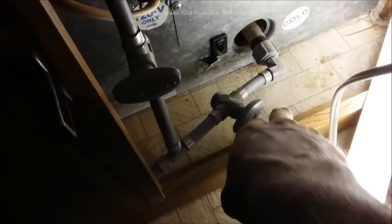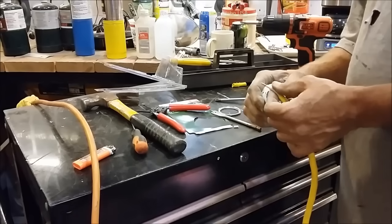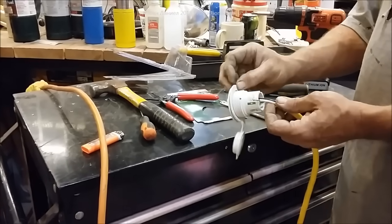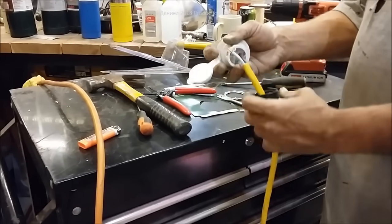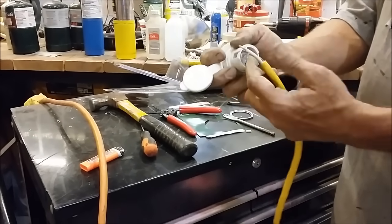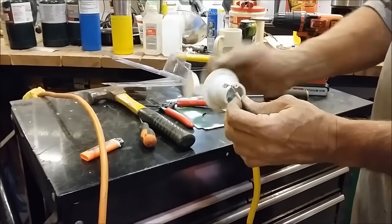Inside, the area underneath the couch is open and that's where the wires are going to go, along with the heater unit wiring. They'll be run down along the nailer board. We're replacing all the old piping with PEX piping so it fully drains. The inlet receptacle is already set up — make sure you have all your parts on before installation because it's a hassle after the fact. I've got the hot on black, ground on green, and the silver screw will get the white wire.